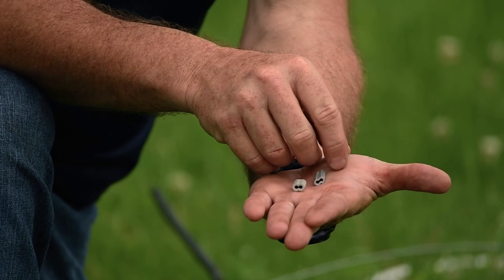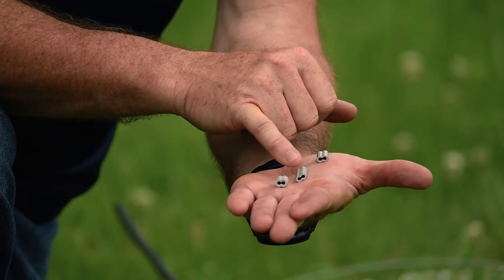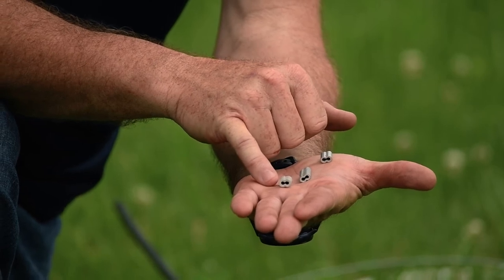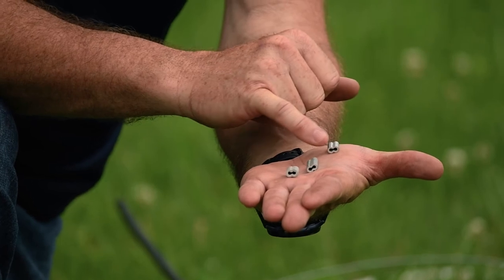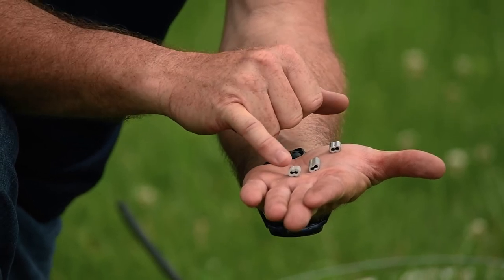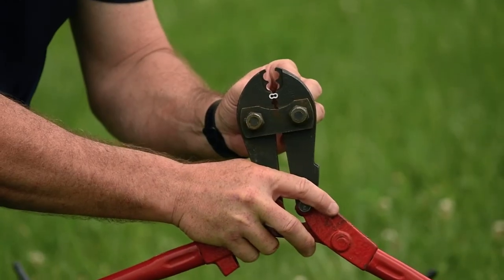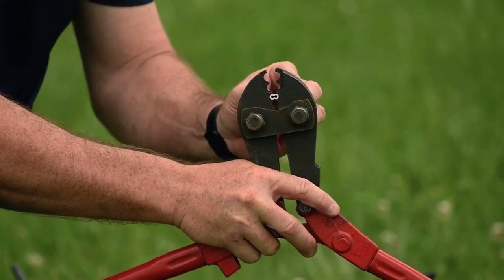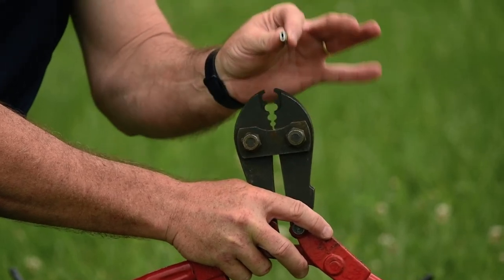These crimping sleeves are comprised of a copper zinc composition, where this one here, the 2-3 long aluminum, is all aluminum. You'll use these on steel wire. You'll utilize these on aluminum wire. Proper alignment will be just like this. As you'll notice, I'll draw it back out for a minute.